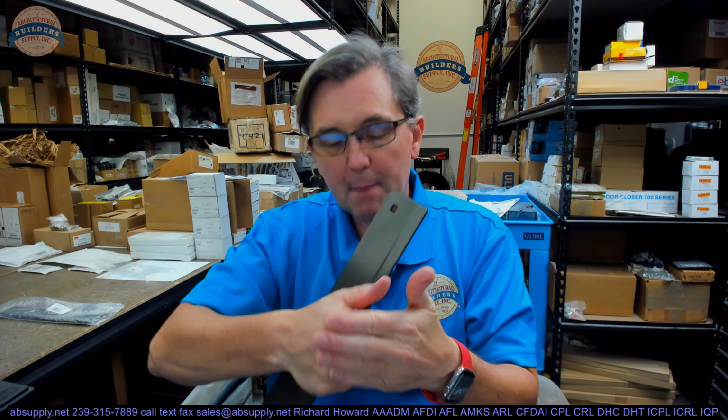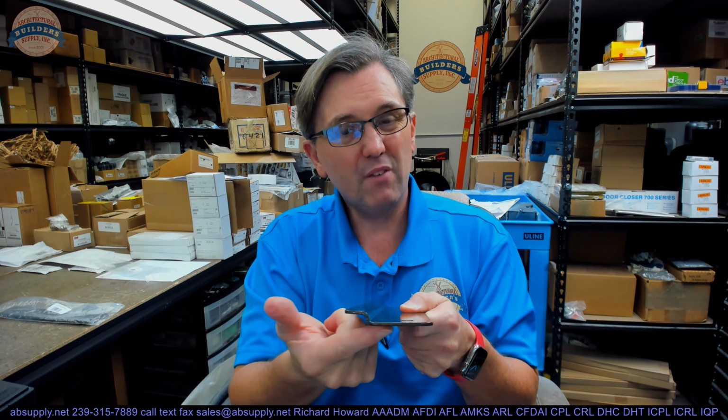Wood doors as well. But you could have a flush condition, but you're accounting for some sort of weird trim that's on the frame. I've had a customer one time needed a large offset because there was casing, brick mold, attached to the pull side of the opening. And he didn't want to get in there and chisel all that away, so he just elected to wrap over that with the offset, kind of like this, right? With the offset astragal. So it could be that you have an inset application, or you have some treatment on the frame that's forcing you to look at an offset like this. It's just heavy on 1/4 inch.